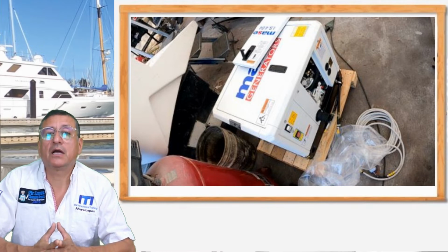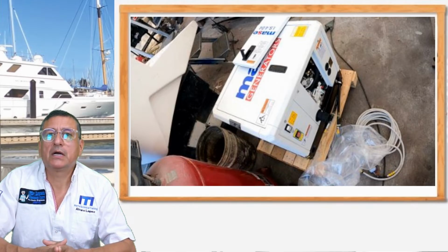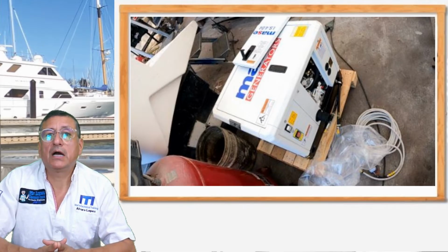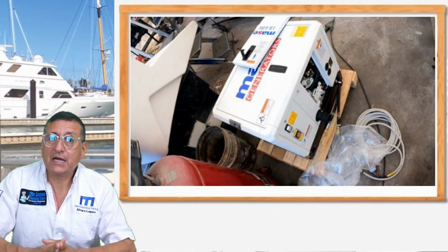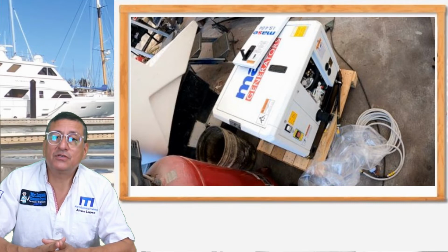It's 120 volts, 60 hertz American power, and we also installed new air conditioning equipment, and we replaced all of those outlets: electrical AC outlets, DC outlets, the lights. We replaced the DC panel with new DC and AC wiring. That was a great project, and this is a typical situation when you need to make a decision to install a generator in another place.